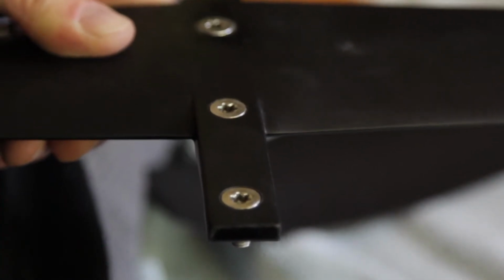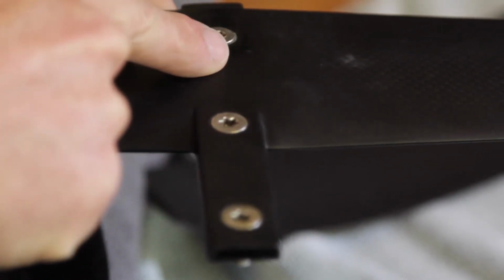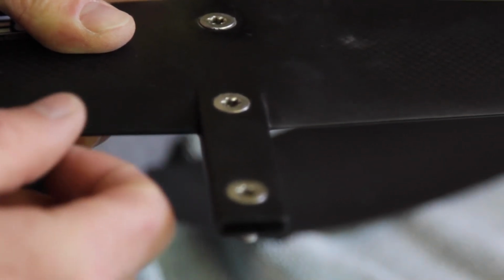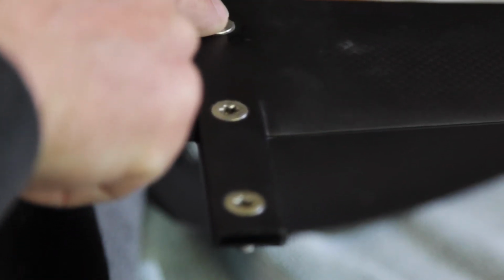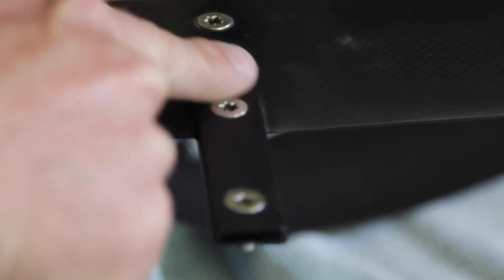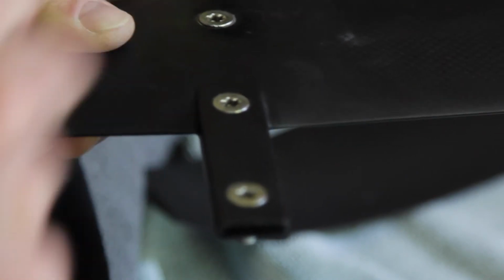Nice, so I got them all sanded flush and matching. The back one here, I didn't over sand down because, I mean, it's very flush, but I wanted to leave a little bit of space just in case it pushes down, because the last time I did the back, I sanded it completely flush and it pushed down a little bit because JB weld, I guess, compressed a little bit, where these are totally flush and this one's just sticking a little bit, but I believe the first time I tighten down, it'll be completely flush.